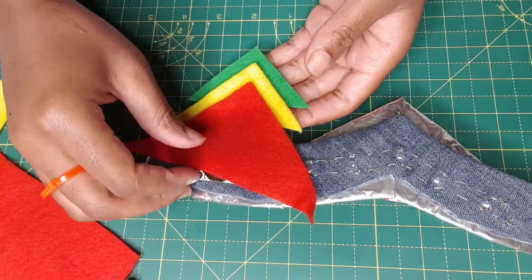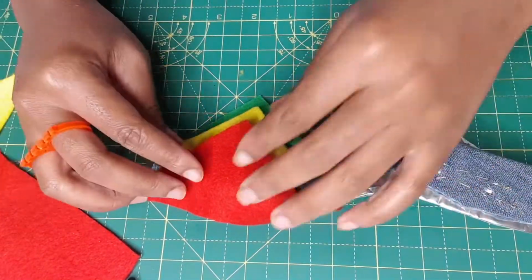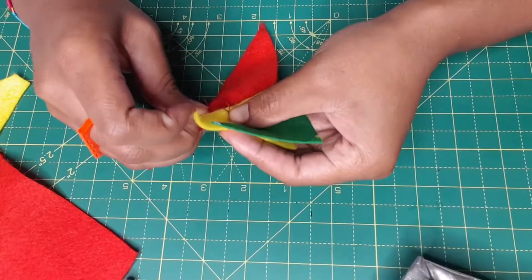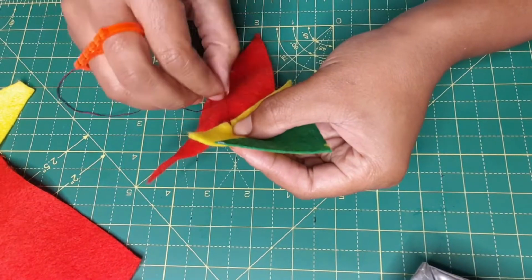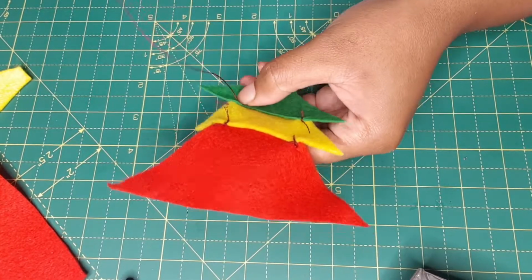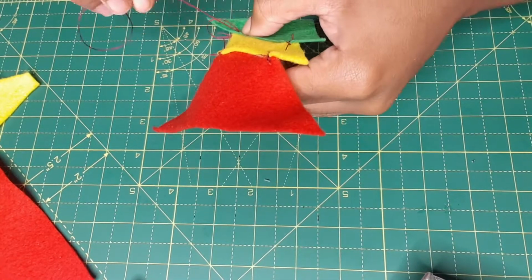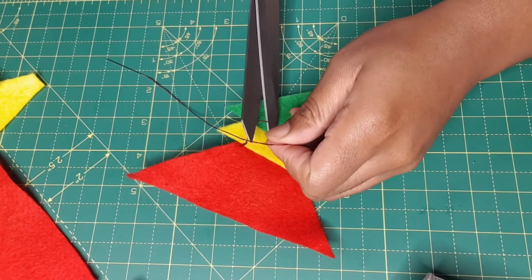As you can see here, my decorative feature is also very handy at hiding the coin cell holder. It's important to make sure that if you do add a decorative feature, you can access your coin cell holder just in case you need to change the battery, and also remember that if it has the button embedded, that you can also press the button.